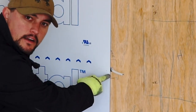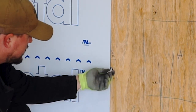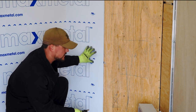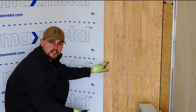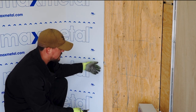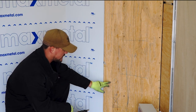I had an outlet marked here — this is going to be for my water pump that's going to go behind my sinks, next to my fresh water tank right here. I don't like how it landed right on this seam. The good thing about using the plywood base and not cutting out my outlets yet is I can just drill a hole next to this and move my wire over there. It's not going to be a big deal having this hole back here — I've got insulation and then this covering it. Kind of makes it another reason why it's nice working with this material.